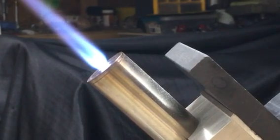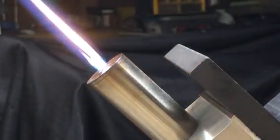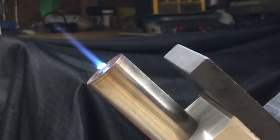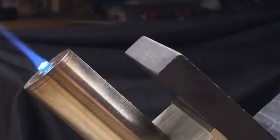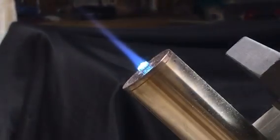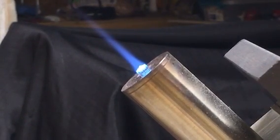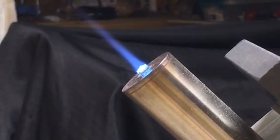This is a really small amount of propane and I'm completely closing off my primary oxygen so that I'm only using my blue valve. With that you can get a really small flame, and just using your blue valve it'll actually keep the flame a little bit off of the torch face. If you can see up close, it actually isn't physically touching the metal — that you can do with just your propane and blue oxygen.